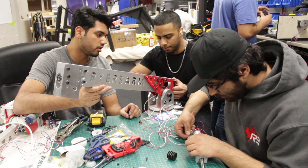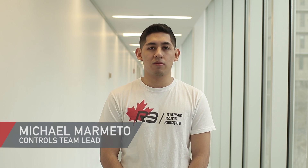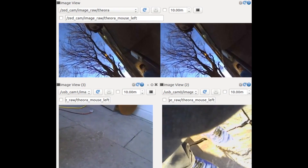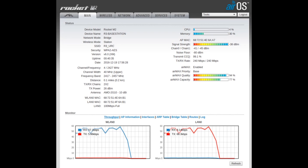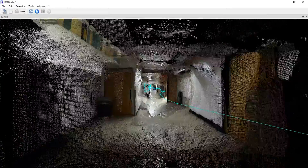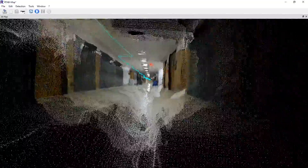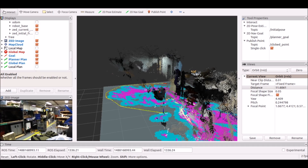Taking off the gripper allows for an auger to be installed so the science task can benefit from the continuous rotation of the wrist in order to drill soil. Our goal was to create a highly reconfigurable and reliable system focusing on solid communication and visuals. We are using 2.4 GHz omnidirectional radios to transmit high definition video feeds and other signals that demand large bandwidth. Pairing these with 900 MHz access points ensures that we never lose critical control transmission. For the autonomous task, we are taking advantage of the ZED stereo camera to provide us with RGB and depth data. Our approach uses ROS relays to save bandwidth and the real-time appearance-based mapping package to perform outdoor simultaneous localization and mapping, which can handle varying degrees of sloped landscapes.